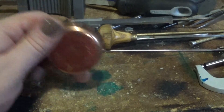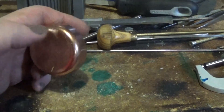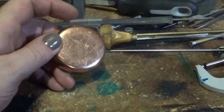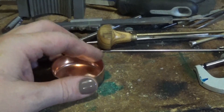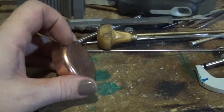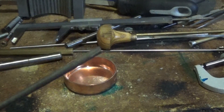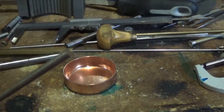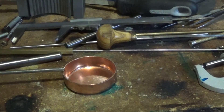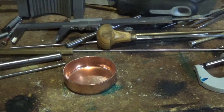And some sort of insulation. So let's get in and get some 3/16 brass and turn it down to one eighth, and drill and tap this in a couple of spots, screw the legs in. We might get a hand graver out and clean them — the legs off on the other end — to a nice sort of shape. And we've got a bit of about 4mm soft steel rod there; we might make a handle out of that, and see what we end up with. So let's get in and do it.